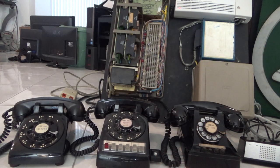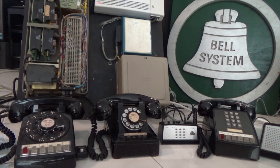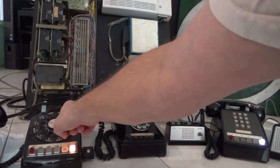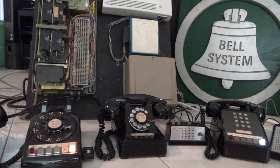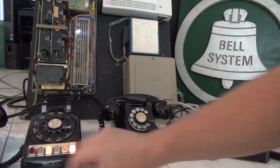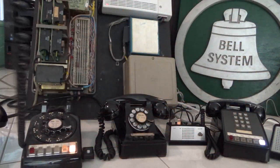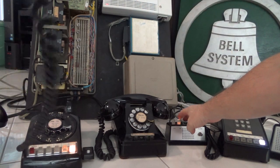Now I'll buzz the 2565 set — it's set up as intercom zero. I go off hook on this phone, dial zero and it buzzes. You can see the hold button is also rigged to light up. You can go off hook with the speakerphone as well — pressing line five. We're on speakerphone momentarily, then I'll hang that up. This phone has four lines, you can put all four on hold, buzz it, and retrieve any line from any of these phones.